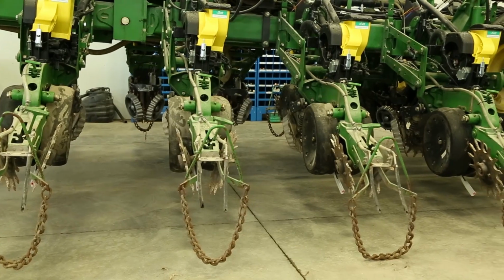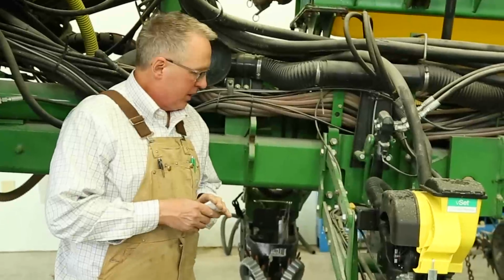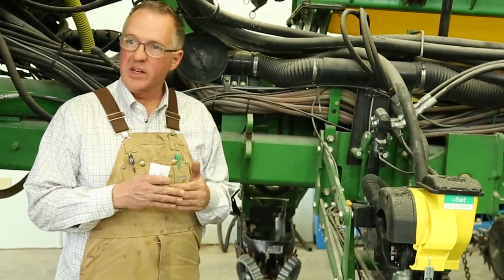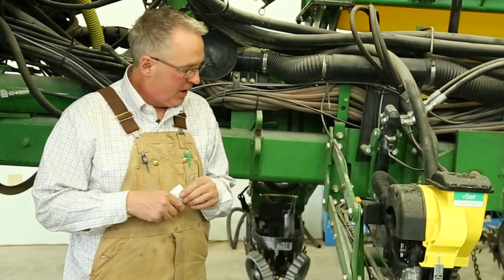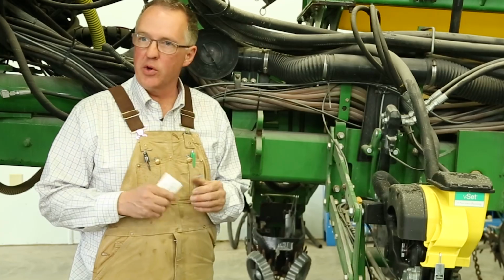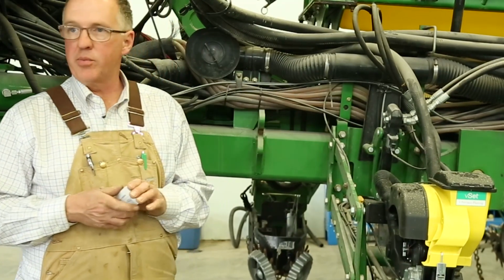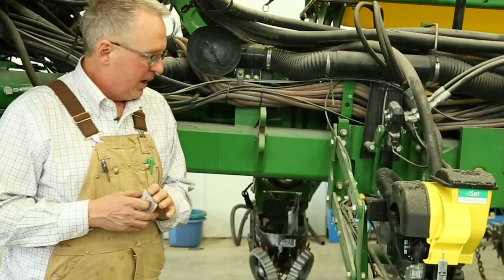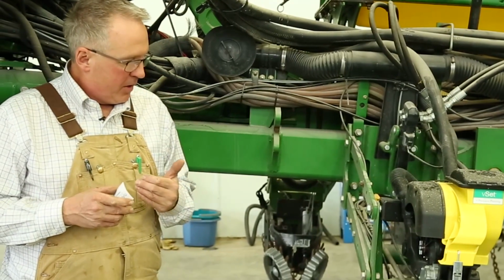We mentioned that nitrogen is very important. Years ago, we used to have a fertilizer opener like in a 2x2 or a 2x3, 2 inches over, 2 inches down, where we would put our nitrogen on maybe over 3 inches. In our case, we're working with 32% UAN nitrogen, and we found that those row units